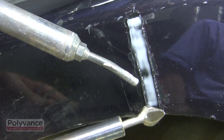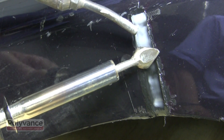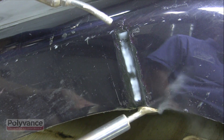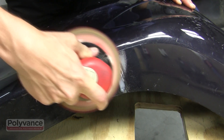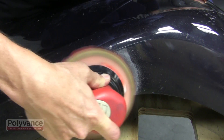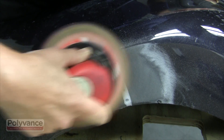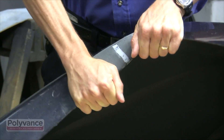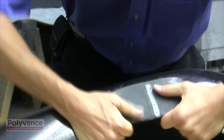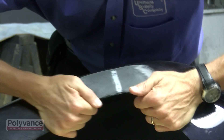On the front side, it's best to smooth out the welding rod to make it easier to sand. Focus the hot nitrogen on the welding rod, start to turn it clear, then use your airless welder to smooth the rod. It's best to use a light touch and don't let the airless tip dig into the plastic. As always, practice makes perfect! After letting the welding rod cool completely, sand it with 80-grit and a DA sander. The polypropylene rod will feather out nicely on the bumper, indicating a strong bond. After the weld is completely cool, test your weld's strength. Often you have to fold the bumper completely in half to get a tear started. If the strength of the weld isn't what you expected, keep practicing on the scrap bumper until you can't tear your weld.